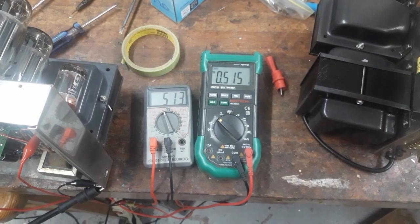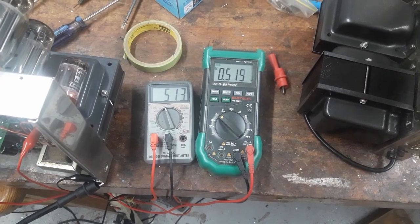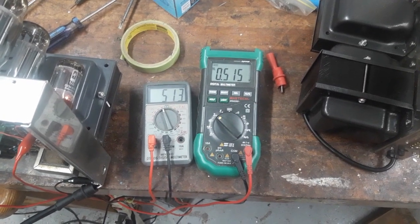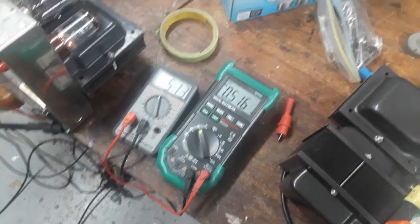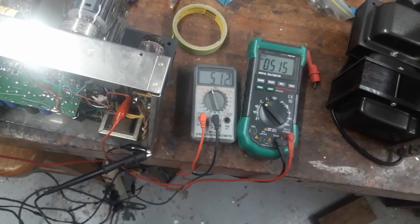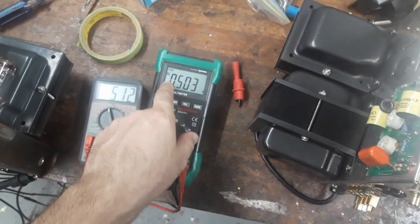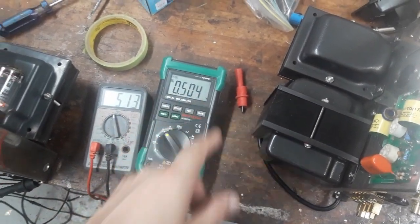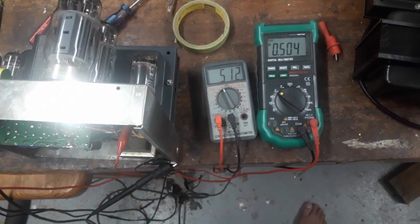Okay, look at these figures. On the left again is the plate voltage right off the rectifier, and on the right is the bias current. I could play with the balance a bit more, but basically, putting it into both of those socket spots there, I'm getting very close current. Now this will constantly move around as the amp heats up and so on, right? So every time you measure it, you're going to get a different figure, and they will change.